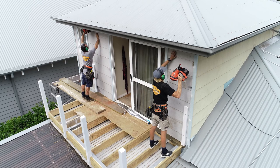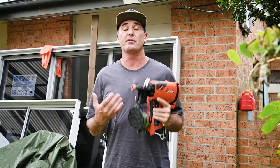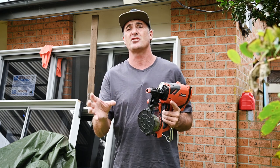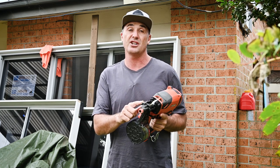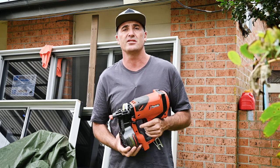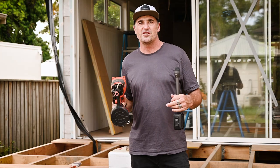Something a lot of people might not realise is you can go from using products like Secura FC flooring in your bathrooms with the same gun and the same nails — step from the bathroom on a 17 or 19mm product — out into your eave sheets, Villa board, things like that. All you need to do is adjust your depth setting. So you've got so many good reasons and so much flexibility with this awesome product.